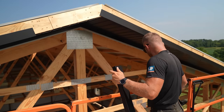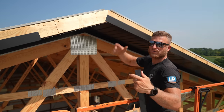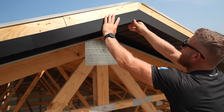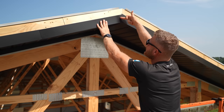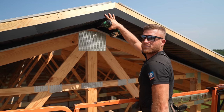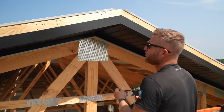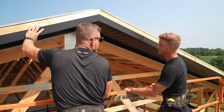One thing we do with our fascia trim here is this guy ran underneath and long, in the direction that you're not going to be looking from. You're mainly going to be looking from the left because that's the front of the property. So we come in and put this piece here so the lap is covered up. When you're on this angle looking, you're not going to come over here and see this shadow line. Also, because it's underlapped like that, it gives us a little added layer of protection from moisture that might be wind-driven. That is the last little piece of fascia right there, so now we can put our gable on. Greg, give yourself a clap.